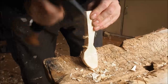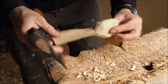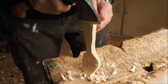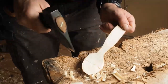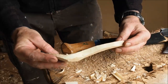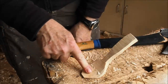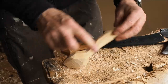We're working a bit more here and that will probably do. The top of the handle here could take a tiny bit more. That will do. So there it is — there's our spoon. With an eating spoon, what you're looking for really is that 30 to 40 degrees of crank between the front of the bowl and the angle up of the handle.